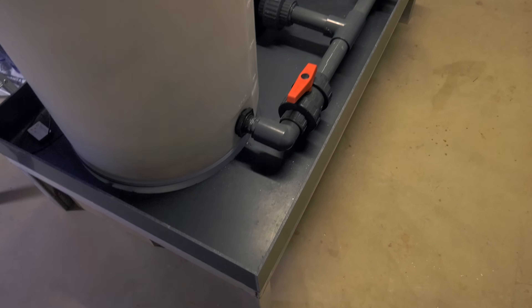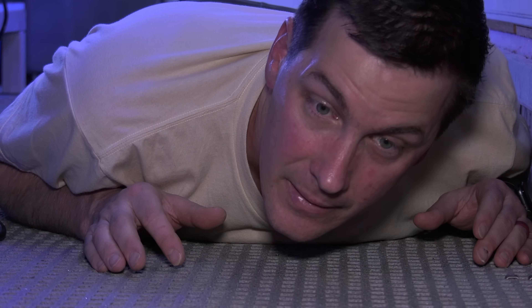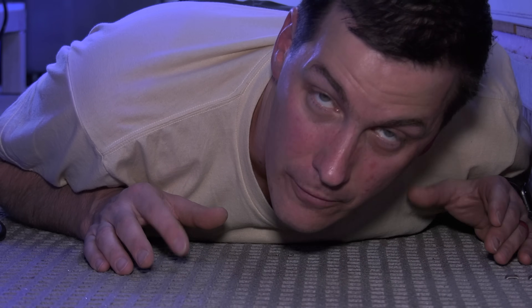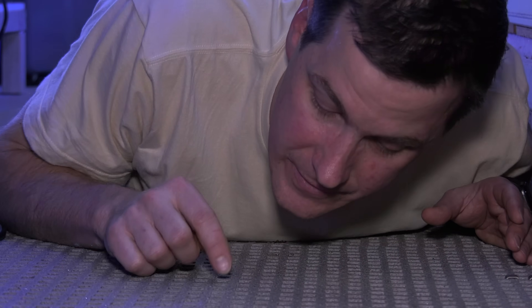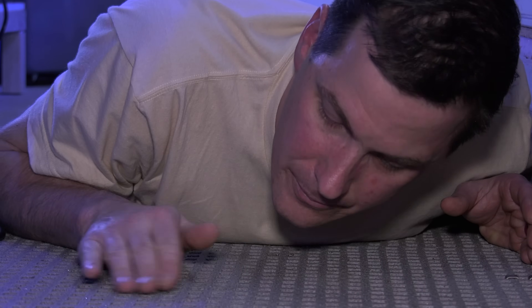While we're talking about drip trays to a floor drain, what about not needing a drip tray at all? Down here on the floor, you'll notice my mixing station doesn't have a floor drain. Why not? Because the floor underneath the fiberglass grating in my fish room is drained. If I overflow my mixing station, water flows through the fiberglass grating and rolls over to the floor drain. Therefore, no drip tray is needed. I love my raised drain floor.